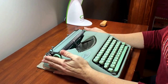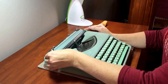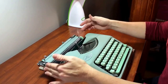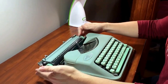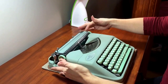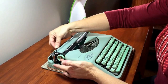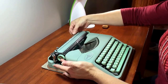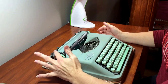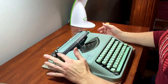To start typing you pull out the carriage lever — it folds up for storage in the case, and then you open it. The carriage release is right here, a little lever you pull forward. The margin stops are in the back; you press down and slide to set your margins, and both of them work. The line spacing mechanism is right here — pushed all the way to the back it's single space, pull it all the way forward and the manual says it's double spaced, but it's really just a space and a half.